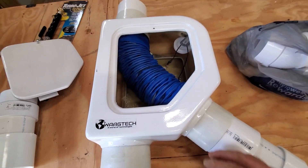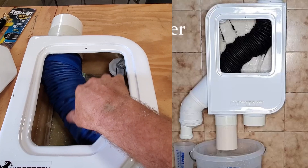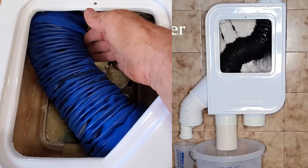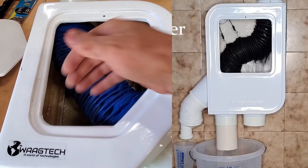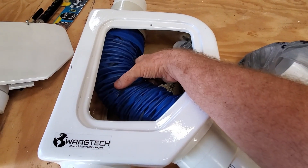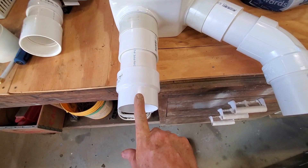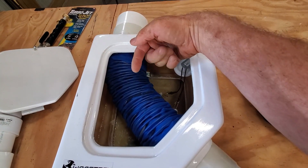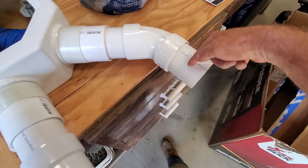This is the inside of the filter. The water would be coming from here — this is where you connect your downspout. This is a mesh filter that as you get more and more rain, it actually sits further and further down, so more water is able to come through. The more water that comes through the system, the more water is able to come through this pipe, which is your discharge pipe, to wherever you're trying to collect the water. All the debris that comes through from the top ends up in this filter and it can't get through, so it eventually just washes through and out here.